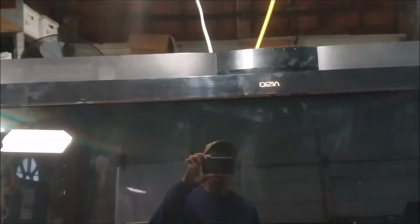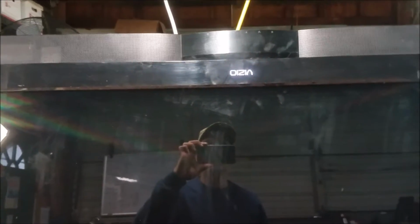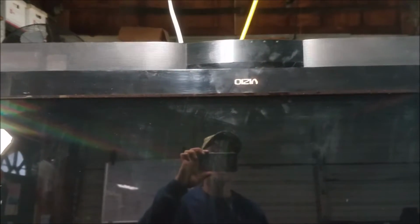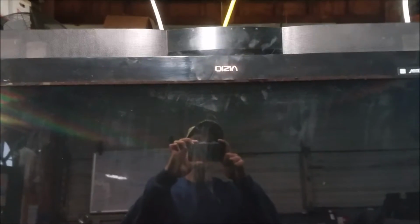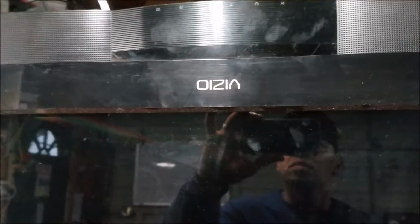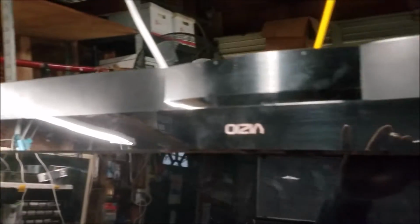So I plug the TV on. The TV is flashing orange and white. It's gonna be flashing like this for about a minute to 3 minutes. Sometimes in this step it's loading the software. If it keeps flashing like this more than 5 minutes, yeah, you have a problem in the main board. So let's wait for it till it stops flashing, then we power on the TV. We got a solid orange light now, so let's power on the TV.